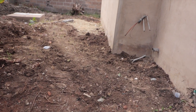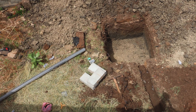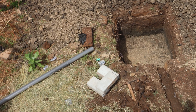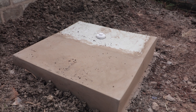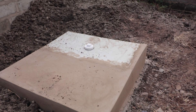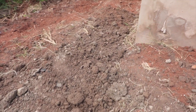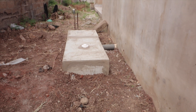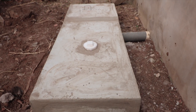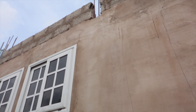We did the connection here — you can see this job just finished — and then you can see the connection all the way leading here. We used a three-inch pipe to have the connection done. This is the soak away with an overflow pipe underneath, and an inspection chamber as well. The other biodigester is also here — that one is here with the same mindset. We did it closer to the inlet pipe so we just had to do the connection ourselves. The one from the top will come all the way and be joined to it.